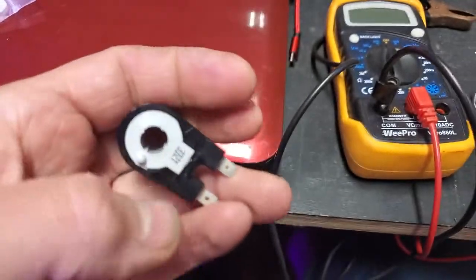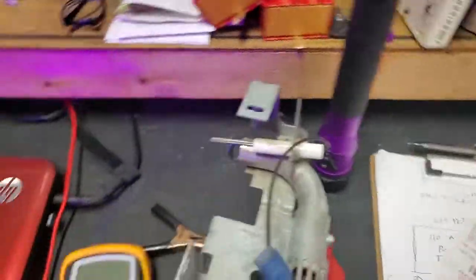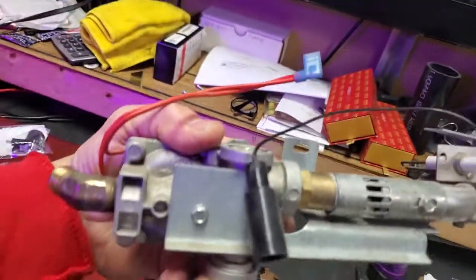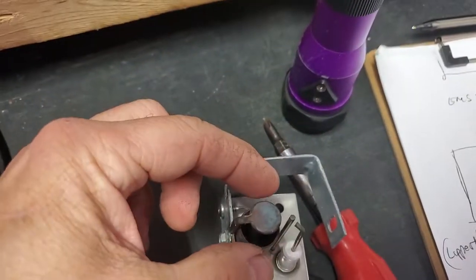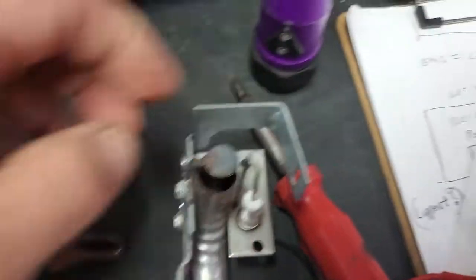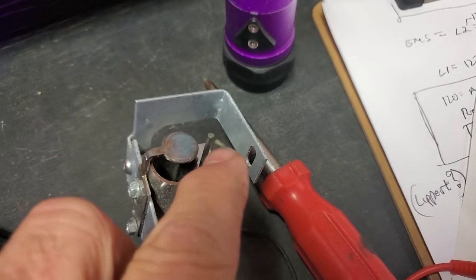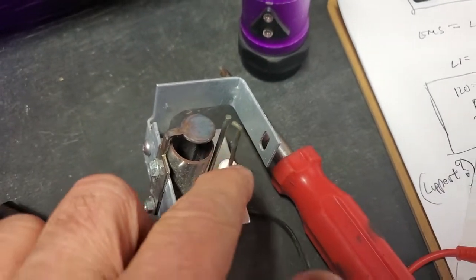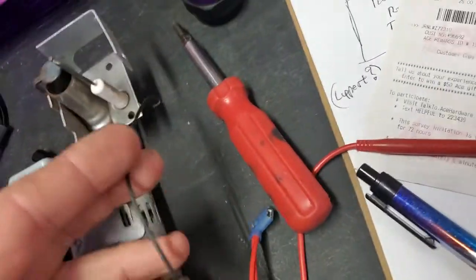They should ohm out about 20 ohms apiece. Here's the gas valve assembly right there — it should be familiar to you. It sets like this, basically, into the water tank. Right there's your igniter, with the eighth-inch gap. This part of the igniter becomes a flame detector sensor. The temperature goes back and changes the DSI board — direct spark ignition board.